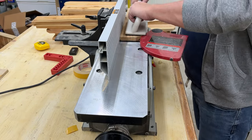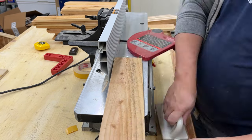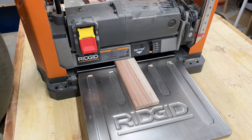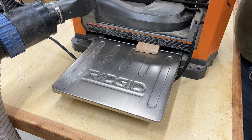At this point the wood is still really rough, so a couple passes over at the jointer will give it a nice flat face and a nice square edge. After that it's over to the planer to take everything down to the right thickness and smooth everything out. I'm making everything three-eighths of an inch thick here.